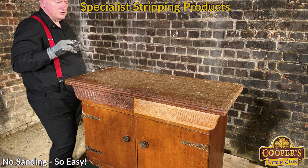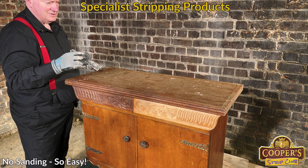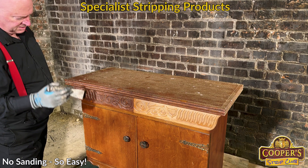The original colour is going to be so much nicer. This would have been originally finished in a light golden colour, which is perfect for the oak. Then some time later it probably had some marks, and so the whole piece was recoated over the original finish with some tinted varnish. And that will have turned it to this whole mud look. Just little tests, little tests.